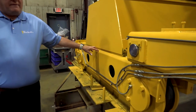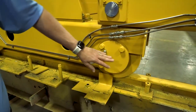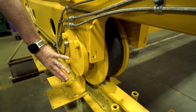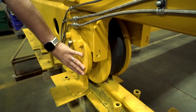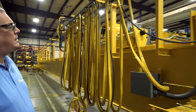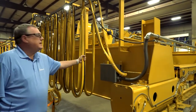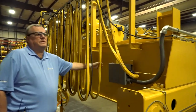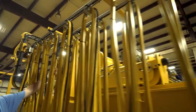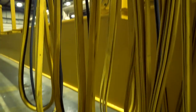These are our heavy-duty tube style end trucks that we fabricate and machine in-house, along with rotating axle type wheel assemblies in steel bearing caps with spherical roller bearings. For the trolley conductor system, we have a festoon cable system along with a backup pendant system for emergency operation. It features a quick disconnect plug for the pendant so it can be removed and placed in operation rather quickly.